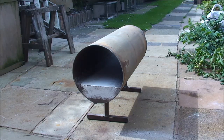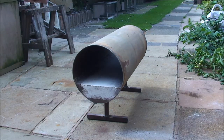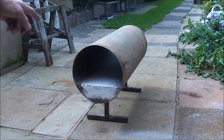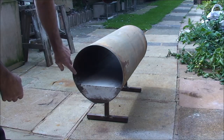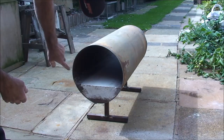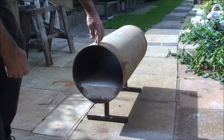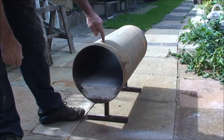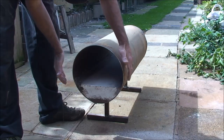Because the sword is longer than anything I've forged before, I realized I was going to have to make a larger oven to heat treat the blade. What I've come up with is this ex-gas bottle — this was actually the first rocket stove I made, just reused many times. These bottles are 15 inches wide in the UK. I cut the bottom and top off, sliced it down the seam, then put ratchet straps on and ratchet-strapped it down until it reduced in size to 12 inches.